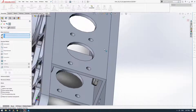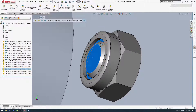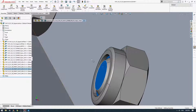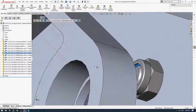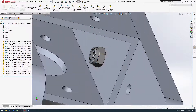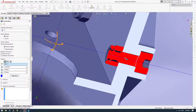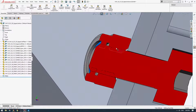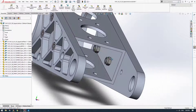We can also see that the ends of the bolts come right through the nut. The key thing is you just want to make sure that the bolt is long enough so that some of the threads contact the nylon — this blue nylon part. Let's take a quick section view. If the bolt stopped short here, it wouldn't contact the nylon because the nylon only starts at this point. You need to make sure your bolts are long enough so they come all the way through the nut and actually thread into the nylon part — otherwise it's just like a normal nut and it will fall off. That's pretty critical.